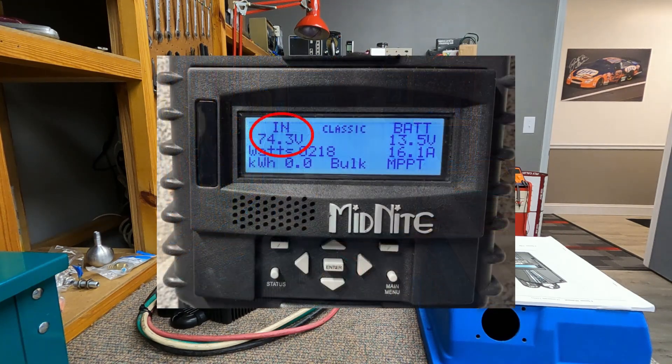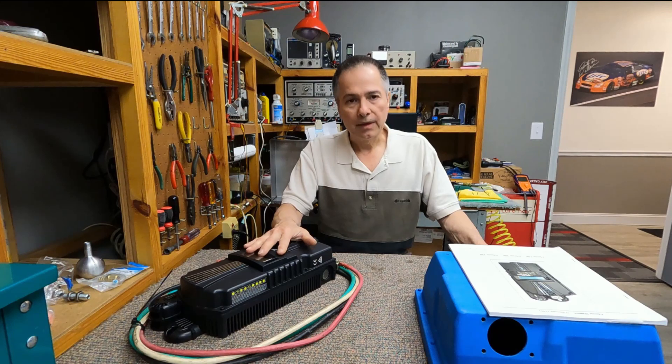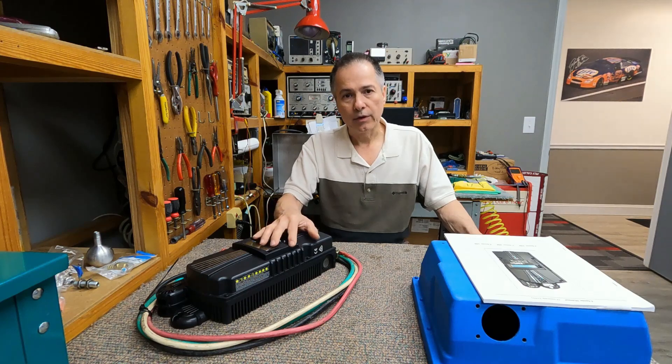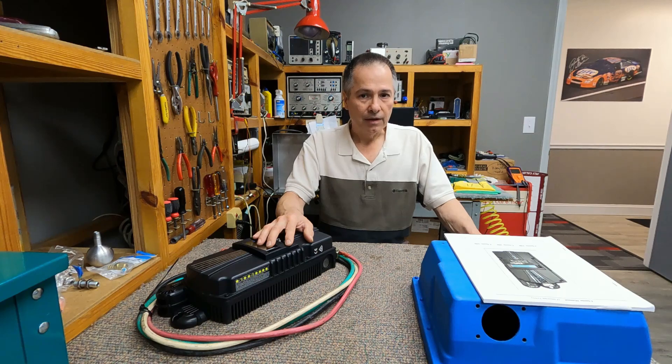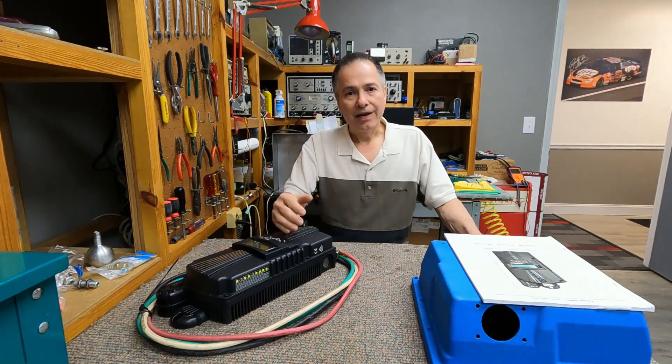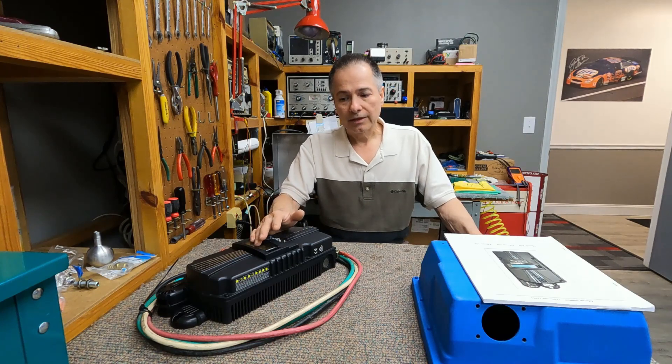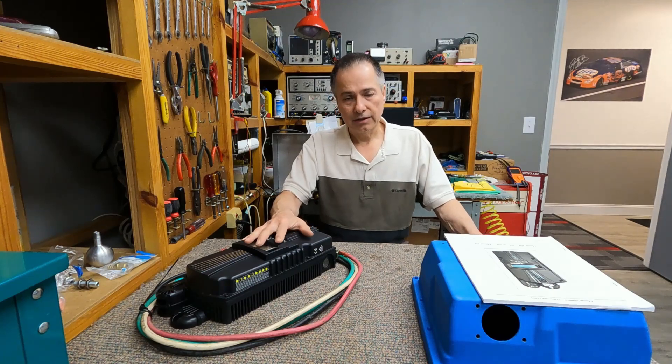By tracking the input voltage that's displayed and sending it to manual mode, I was able to do much better than having it automatically sweep. While it does a sweep you're actually losing power, and it takes a few minutes to find that point and regain full power. I also found that on occasions it would not get to the same point — it wouldn't find the maximum power point and would actually be lower than previous readings. So it's not consistent even though our water is consistent; the unit itself isn't.